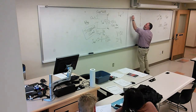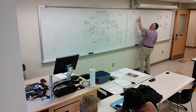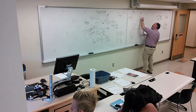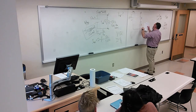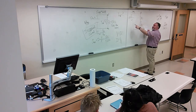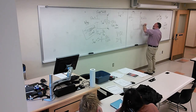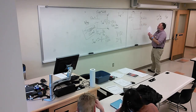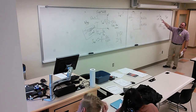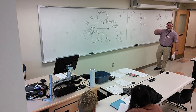That's the same. This is I total. That's the same. This is a position called A. I like to call it A. This is the needle. This is called B. This is called C. This is a resistor, and so is this. But now we have two. This one's called the first resistor. This one's called the second resistor. And these guys have different values than before. This guy is 12,000 ohms, and this guy is 24,000 ohms. Okay? Just consolidating what we've already done, this looks very similar to the problem we just saw. It looks very similar to all electronics questions. I know what these symbols mean, so we're good to go.